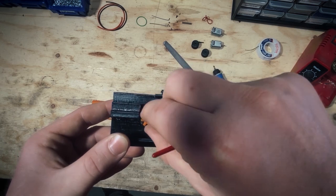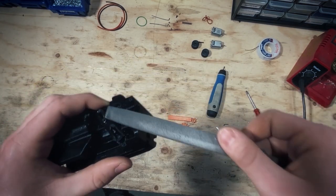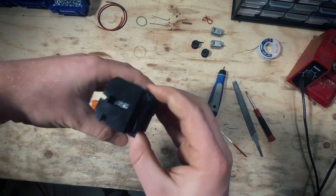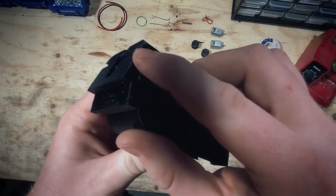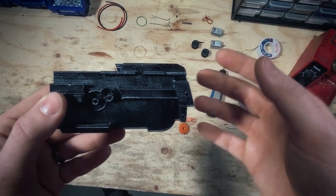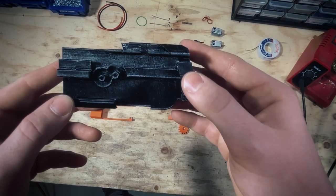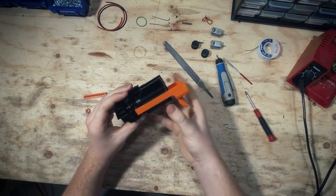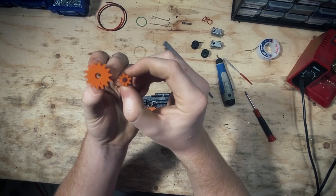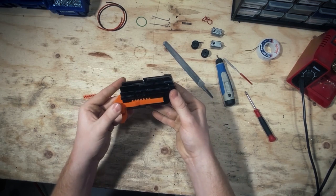Along these pillars there can sometimes be a little excess from the printer — take the file along those spots and make sure the pillars end up being round so they don't rub too much on the gears, allowing the gears to spin freely and independently. Additionally, I like to take a larger file or a knife and run it back and forth along this edge going all the way around — the slide is going to be sliding around this constantly, so take off that elephant's foot so the slide doesn't have anything to work against. The general rule: isolate a part, make sure it can move where it's supposed to — if it can't, find the problem, file it down, put some lube on it. We're not going to put the spring in yet.